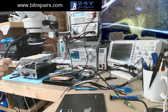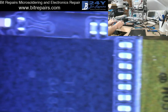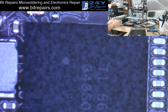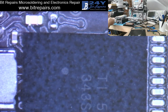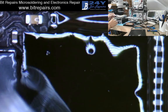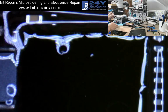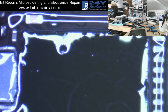I'm going to use some flux now - let's get this in view. You can see the chip that I have just surrounded. Remember where that dot is - it's in the top left corner in the orientation I've got it. That's the chip we're going to be taking off now. Before we heat it up, we're just going to stick a big glob of flux all over the top, spread it all around. We've got loads of flux on this because what we want to do ideally is try to get this chip off nice and cleanly. Let's say 50% of the time you can reuse these chips - if I can get this off cleanly and put it straight back on again, then absolutely brilliant.